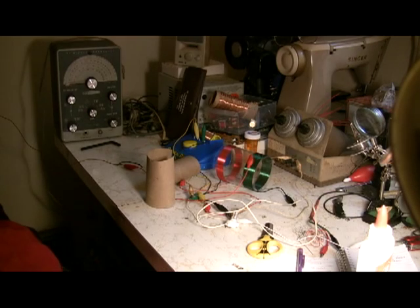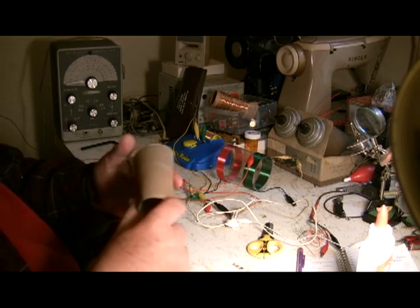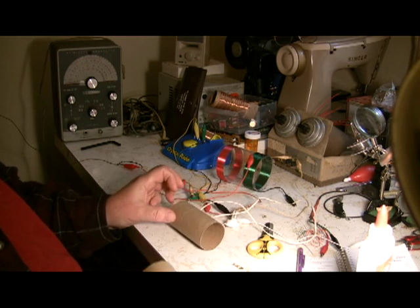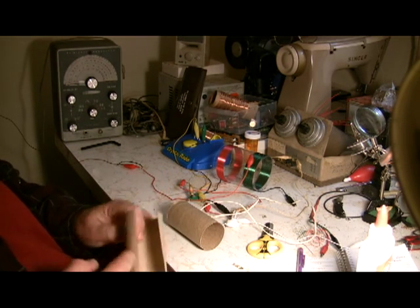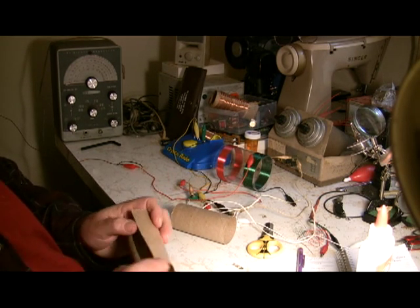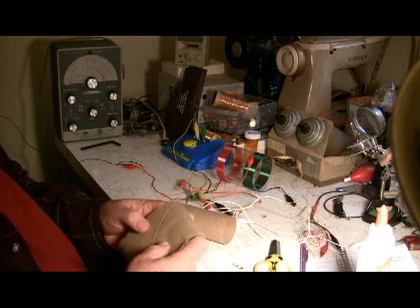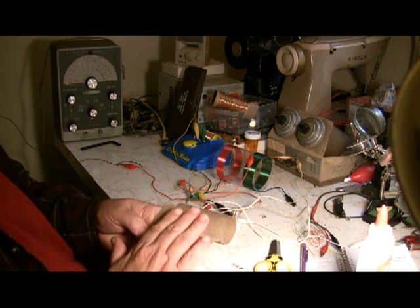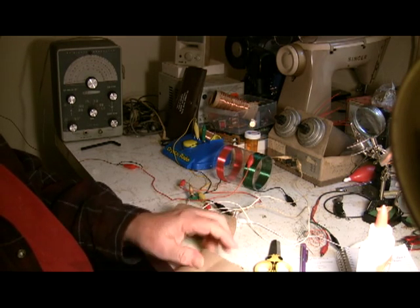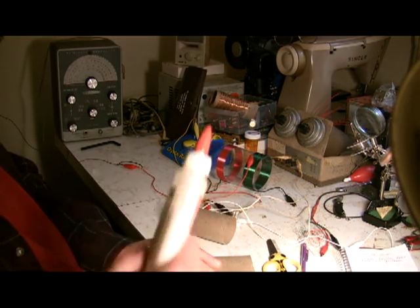Okay, let's make a coil for our radio. Here's one of those ideas — since these are so flimsy, take one, take an extra one, cut it down the line, fold it over, stick it in, and mark the overlap. Bring it back out, cut it. Now we're going to take and put some good old Elmers on this, smear it around, stick it in there, and make this tube more reinforced.